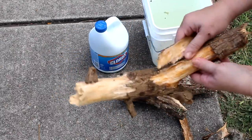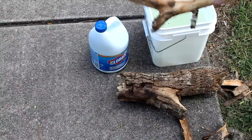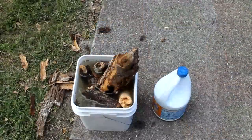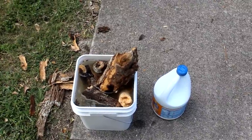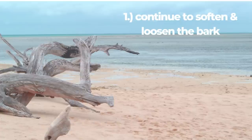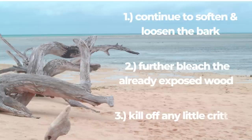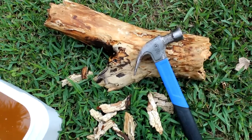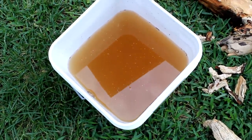You want to try to find pieces where the bark is gone or peeling off. To help nature along, I filled a bucket with water and added a cup of bleach. After washing the branches and peeling off as much of the bark as I could, I put the branches in the bleach. I placed the bucket out of the way and let the branches soak for several days. Since my bucket wasn't big enough to submerge the entire branch, I did flip them to the other side once a day. My intent was threefold: one, to continue softening and loosening the bark; two, to further bleach the already exposed wood; and three, to kill off any little critters that may have made a home in the log. Each day I also removed any bark that had further loosened, and found that hitting the bark with a hammer to break it up was helpful. Since nature had done a lot of the work already, I found that I only had to soak my branches for about four days to get the desired results.